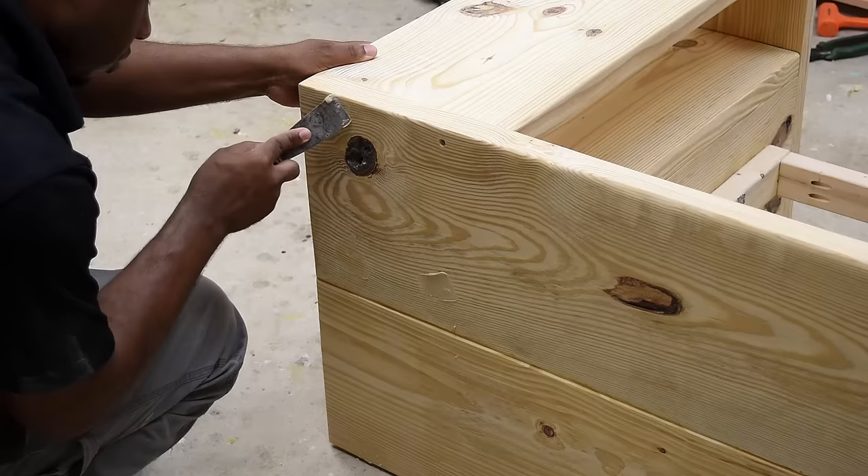This works great on a flat surface but installing this in a room with carpet made things harder because the sofa is much heavier than the front section, making it a challenge to pull out. The slats are going to be attached to the front side — the part that pulls out — so I want to pre-drill those because the holes are so close to the edge I want to make sure the wood doesn't split. I ended up going back to add wood glue, and I'd suggest doing that because this is a moving piece that's going to slide out and likely get bumped side to side, so you want these pieces held into place as long as possible.